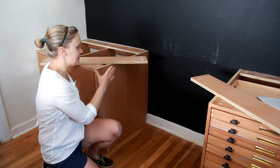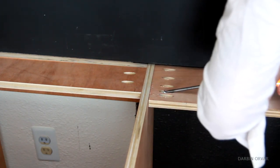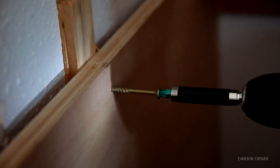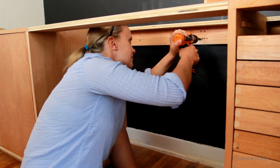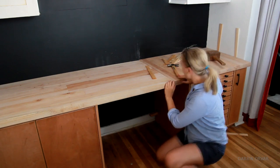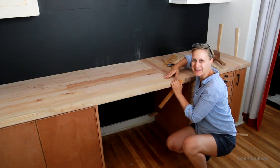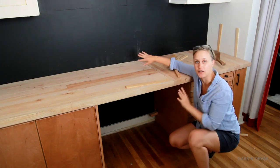So I just put on the doors and this unit in place, and now I want to put on the supporting pieces in between so that I can get ready for the counter. I'm adding some shims and screwing the cabinet into the studs in the walls. I'm adding shims so the cabinets won't get sucked into the wall and out of level when secured. I'm also adding a 2x4 in the back for additional support. So with a little lifting help, this is in place now — the counter. I need to shim it in place. This part right here is pretty perfect, but over here it's down just a little bit. So I'm going to go underneath and shim this in place and hopefully get these nice and even. That's also why I put the 2x4 in the back here, so when I shim it and there's more pressure, there's more support for that back piece.